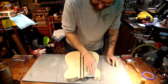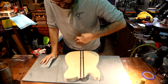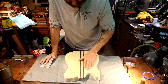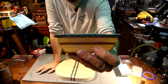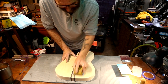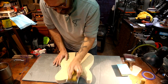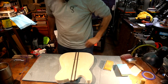I'm telling you guys, you will thank yourself later. I'm taking this soft hand pad now and sanding any areas I know are going to be contoured — like right here on my relief carve on the back of the cutaway and my belly carve. Now we're going to move to our hard interface pad on this block. This is just like a sheet of acrylic with velcro on it that holds the sandpaper, and I want to hit the flat parts of the body with the grain.